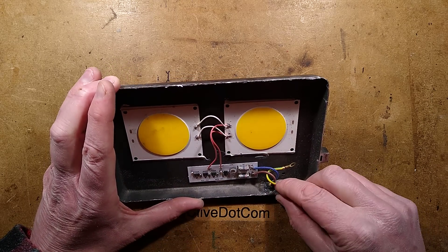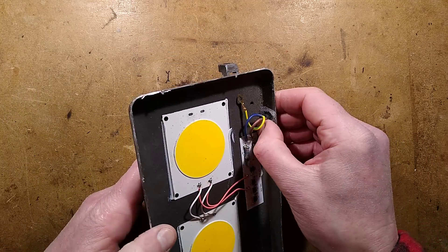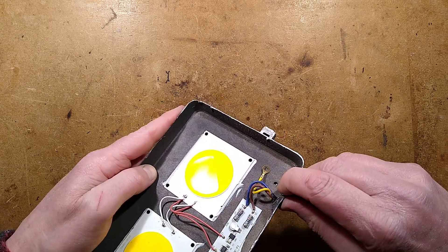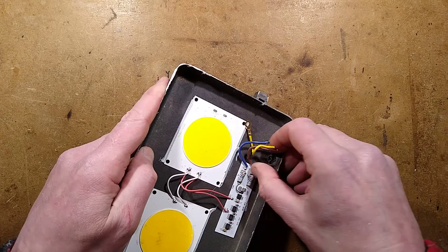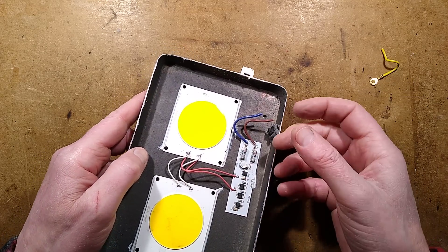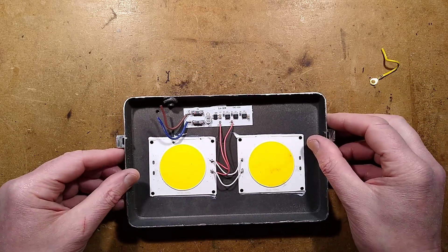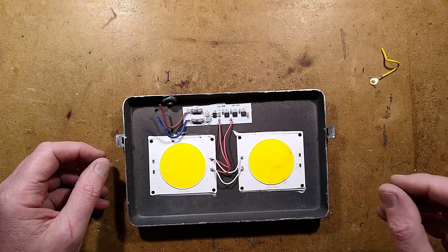The cable entrance — it was jammed through. I think they did make an effort to actually seal it because it's a fairly solid block, and they've glued it in as well. Lovely. But the cable does come through, which means water could have crept through the middle of the wires and into the case. I'm going to take a picture of this and we'll explore that.